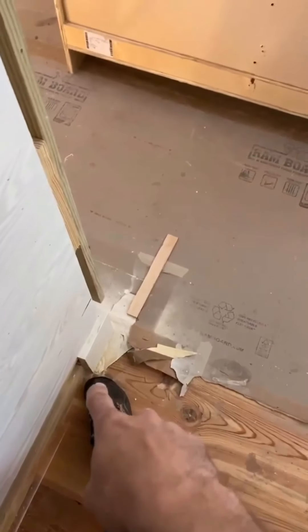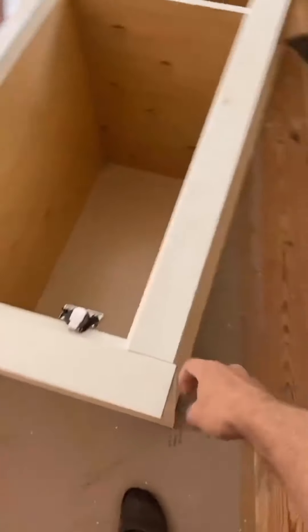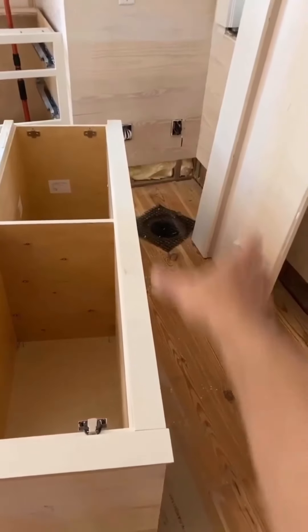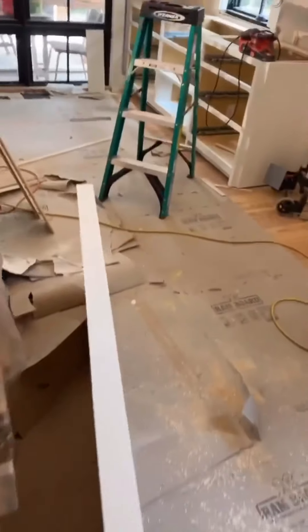I did the same over here where this panel is going to hit — this ended up being an eighth of an inch lower. So we just set this panel at seven foot one-eighth inch, and then that cleat's ready to go right at seven foot. I don't care that these are going to be sticking up because we're going to get casing trim — something that's going on top to clean all that up. Now we'll throw it in.